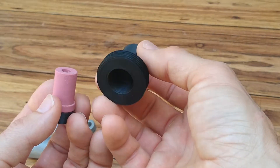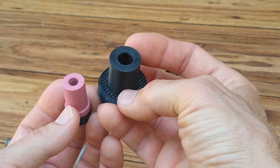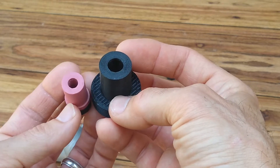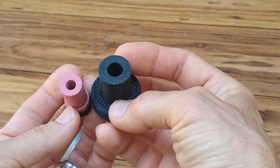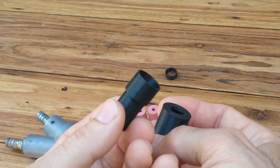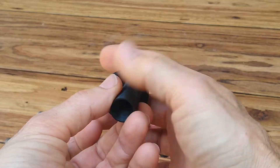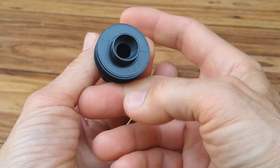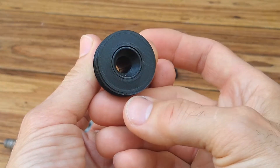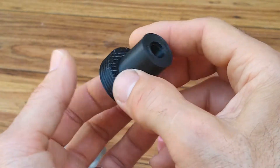I don't have a 10 millimeter nozzle; however, I did have some comments on YouTube saying, 'Why don't you try the 10 millimeter tip? It works a lot better than the 8 millimeter.' So what I decided to do is just print one up. How long this is going to last, I don't know. But it presses in here tight — once it goes in it's hard to get out, so I don't need to glue it. It'll just work as is. Let's go ahead and load this on the gun and put the vapor blast nozzle in the cabinet.